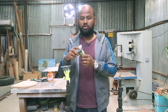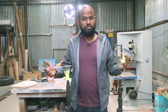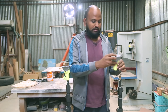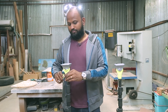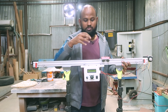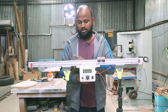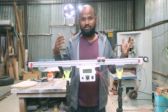Here are some more 3D printed parts — small adapters that go on top of a light stand so that I can place the camera slider on top. Because a DSLR camera is really heavy I'm going to use two stands. You can find the design files for all these components, including the circuit diagram, Gerber file, and PCB design, in the description. The adapters go on the stands and there's a nut to screw and tighten. I also have a 10mm thick plate so that if I'm using a mobile I can use it as a single plate balanced on a single tripod, but for a DSLR I use both stands to take the weight. All components were printed using PLA and they are plenty strong.